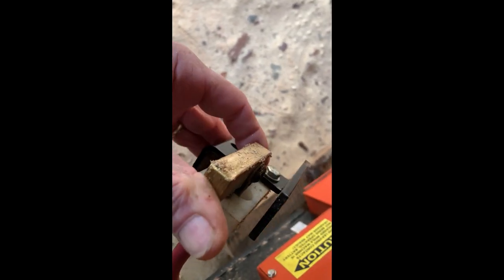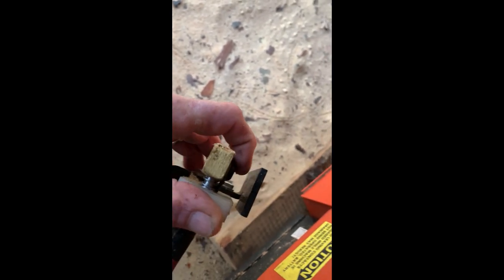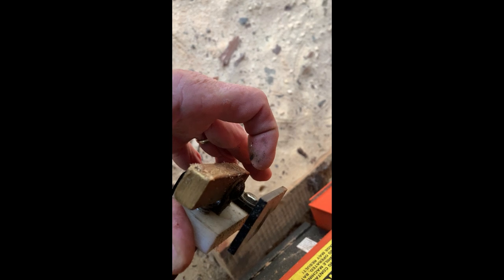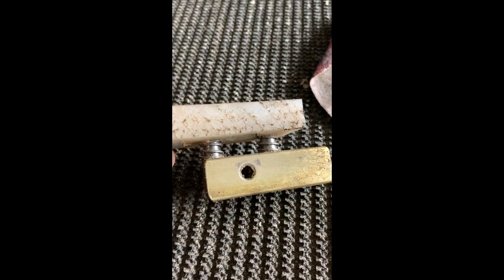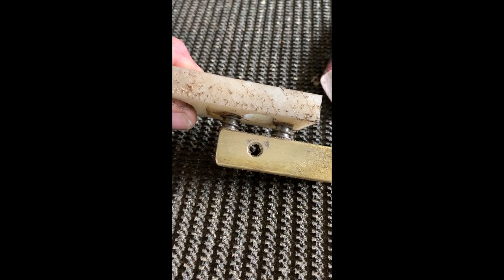After getting back into my shoe and rail electrical connection here, I found that the cable that bolts to the top of this copper shoe is loose. I was checking on it and found out, so that may be some of the issue with what I've got going on. I'm going to take this off and see if it's been arcing underneath there. I've got the shoe cleaned up — you can see there has been arcing underneath. See those two black spots there? That was definitely arcing underneath the cable.